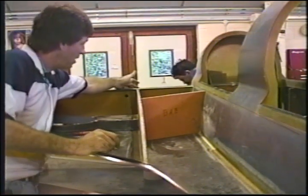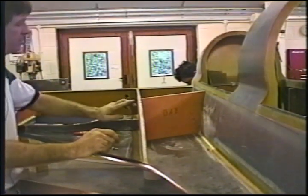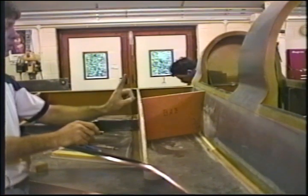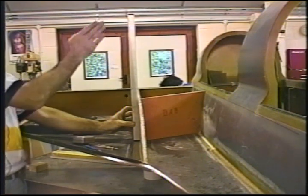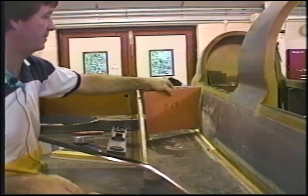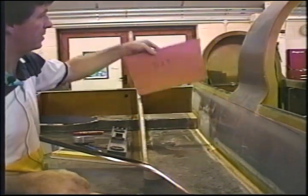From the back of the spar, BL23, draw the line vertical using a level, that is 28 inches forward. Let's place a level here, get the line vertical. We provide you with this template. It's marked BAB. You'll have a little fitting to do. We've got a little bevel here at the top, a little bevel here at the bottom.